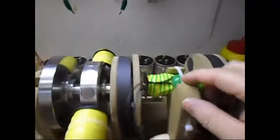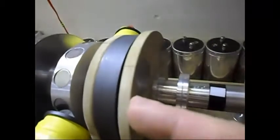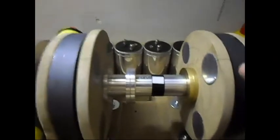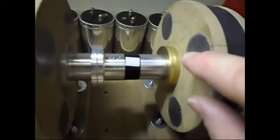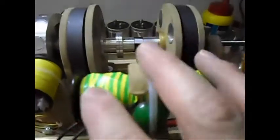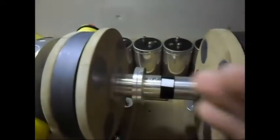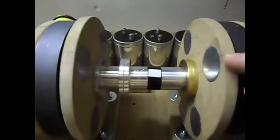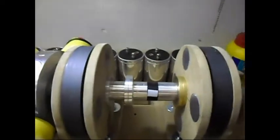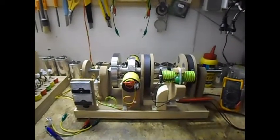Just some quick information I totally forgot to mention: as you can see, the rotor discs are now hitting the coil at the same time on both sides. There's a mark here — that's the center of that disc — and a line here; they're precisely hitting the coil at the same time. Otherwise you won't get any output. It's very important to have them hit the coil at the same time on both sides when you have it in pull mode — north facing in, south facing in. That's it for now, hope you enjoyed that small update, thanks for watching.